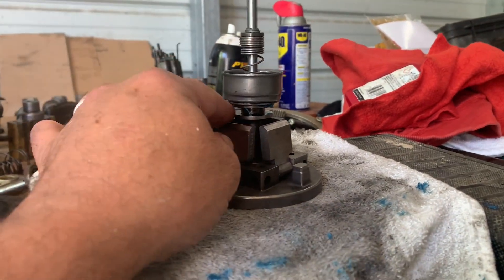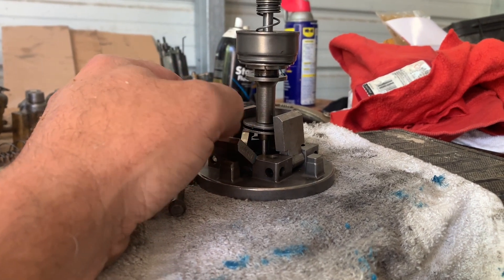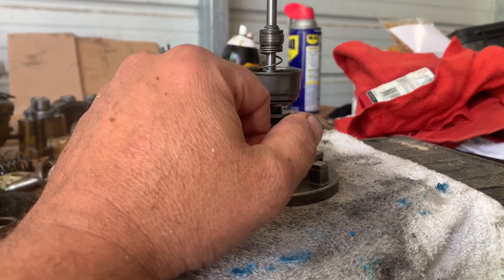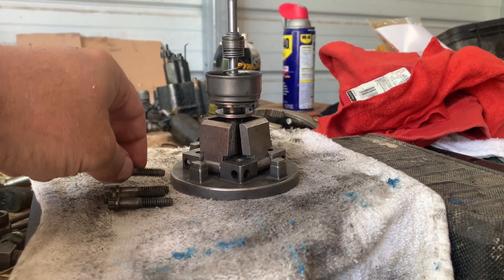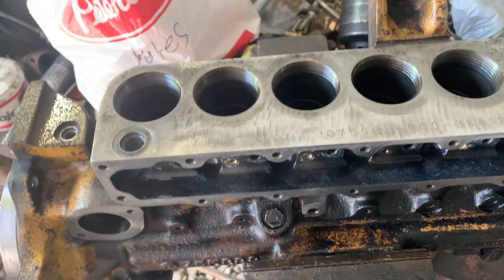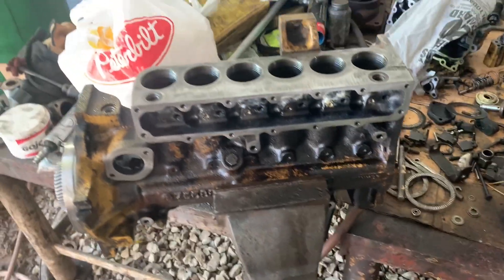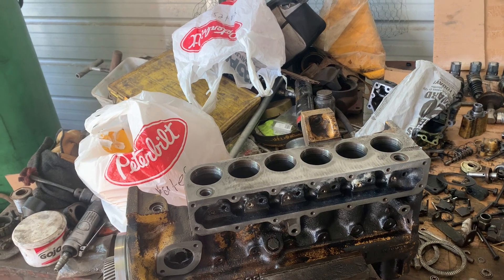When the carriers didn't have those tits sticking on them, when these would flip out all the way it would bust the inner governor housing. I've got some loctite and I'll make sure I remove any oil or debris from the bore of the cam. Then the cam will be seated into place and secured. From that point we'll clean the lifters, drop them in, install the rack, and start putting pumps in - which is very critical and we'll go over thoroughly.